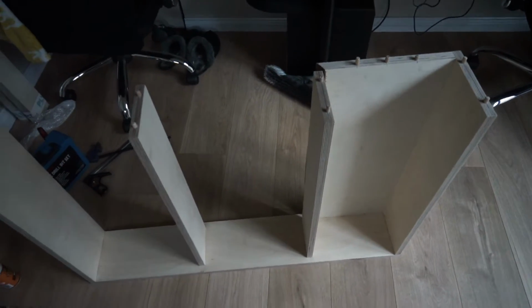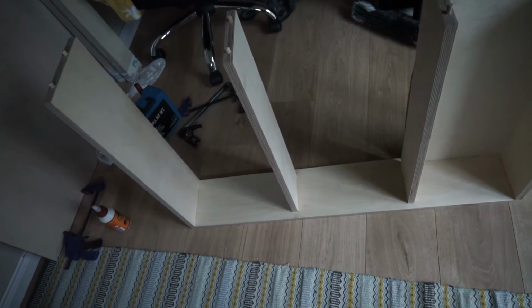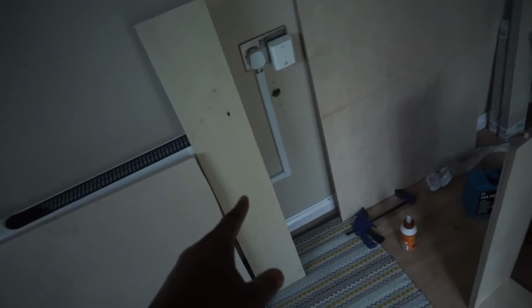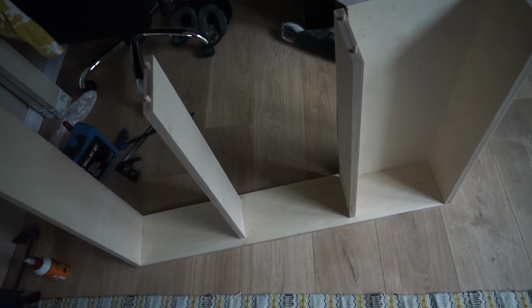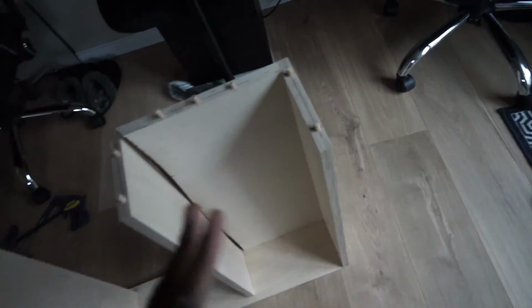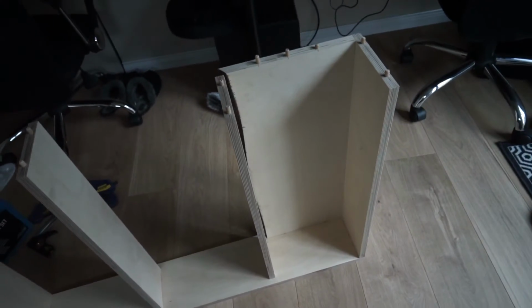Okay, we are making good progress. So the bottom side is completely done. So I'm now going to remove all of these dowels, stick some glue in them, put the dowels back, put the top piece on and get it all glued, flip it over, put some weight on it, and wait for that to dry. And it is coming up really solid. I'm really happy with the way this back piece has come. I do know from previous experience that wood glue is absolutely rock solid.